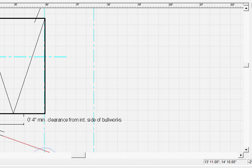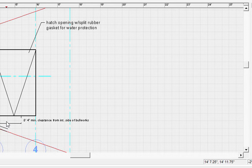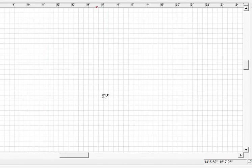2.25 inches in total. It's basically a sheet of plywood from the hull that's got a 3/4 inch piece of African mahogany on the inside and outside, which makes it actually wider than is shown here. But this is the 1.5 inch dimension from the hull inward. There's another piece on the outside, but at any rate, that also doubles as a rub rail, I guess. And so, great hatch here.